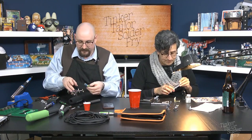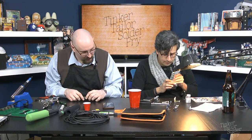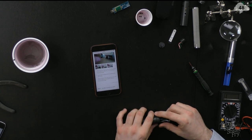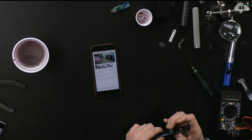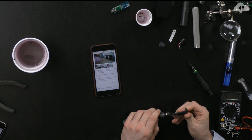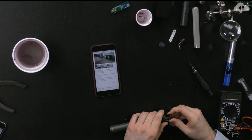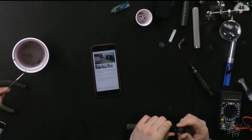Okay, so that's the board. Good job, little board. Now, the next part is, after disconnecting the wires on both the mic caps and the connectors, gently lift the circuit board from the housing. Slowly slide the flange off the mic capsule end of the housing. This is a complete teardown, is it? Yep, pretty much. Flange. This flange? Yes. Okay, I get it. I see what's happening now. So this needs to be removed from this end without breaking anything.